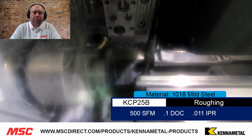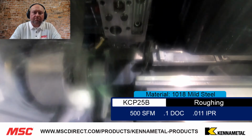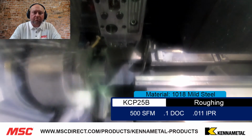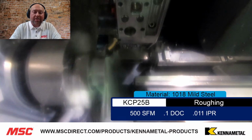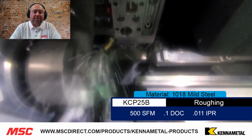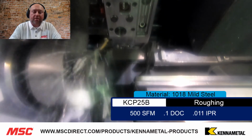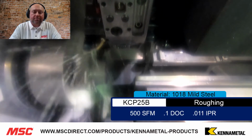Now, Chad, with operations like this, obviously some of the individuals are going to be worried about the inserts and their tool life. So what do you have to say about this specific insert and its performance when it comes to tool life? This tool is going to perform really well on tool life for you at these parameters. Again, it's very safe parameters. That's a good general purpose grade. It's the MN chip breaker that we're running in this demo here, which is just a medium negative chip breaker. You'll get good chip control out of it, and it'll run you a while.